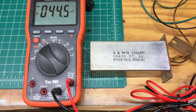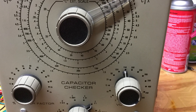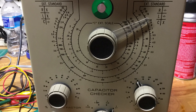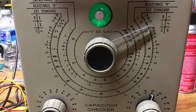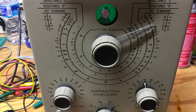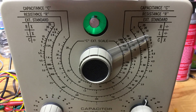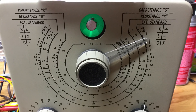One of the two capacitor values tested pretty close — it was closer to the 20 microfarad. The other one was way off, and when doing some leakage tests these things started to break down around 150 volts or so. There's no way I would trust them long term, even though I did bring the radio up briefly just to do some testing. You can see the results — every time I get around 200 volts they break down.